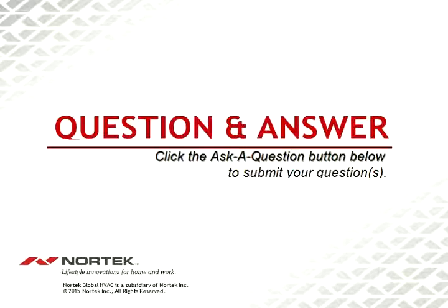First question right off the bat here is, is it easier to troubleshoot the reversing valve in heating mode or cooling mode? Really, it's your option. You can do it either way. I always like troubleshooting in heating mode myself, because then I can use a jumper wire to jump from R to O, energize the reversing valve when I want, disengage it when I want. That way I got complete control.